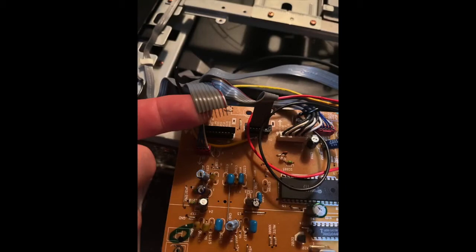What I'm showing you here is where you attach the RF input to the new board from the audio board of the player. The instructions allude to scraping some of the plastic off of pin 6 and then attaching the data cable of the coax to pin 6 — I'm inferring that might mean soldering to it somehow. What I opted to do instead is take the whole cable out and wedge the pin into the connector along with the data cable. To pull it out, there are two little nubs on either side of the black connector — pull up on those to release and remove the cable. Pin 6 is the third from the bottom, labeled RF. Wedge the data cable from the coax into that pin hole, then put the cable back in and push down those nubs on either side to lock it in place.